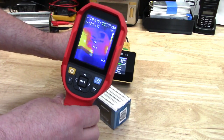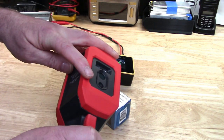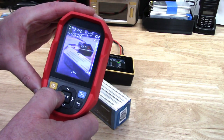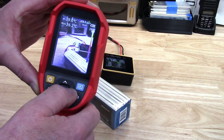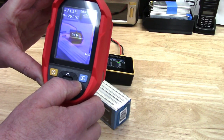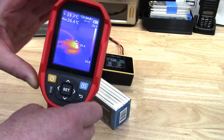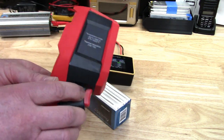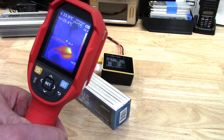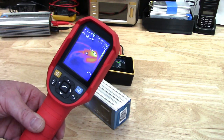The charger is of course getting a little bit warm. This thermal imaging camera has both an infrared camera and a normal visual camera, so you can superimpose the image of the two over top of each other. You can either have full visual camera, or you can keep adding layers of thermal image over top of it in 25% increments. Because the cameras are spaced a little ways apart you get a bit of parallax error, but you can correct for that in the settings — we'll go through that when we check over the menu at the end of the video.